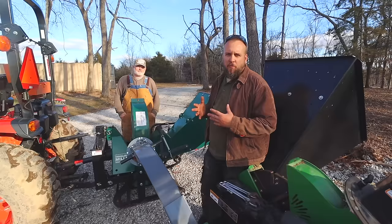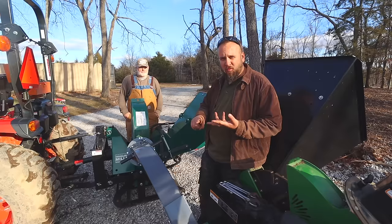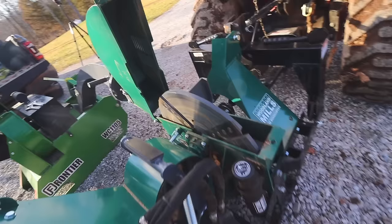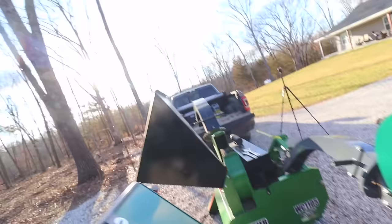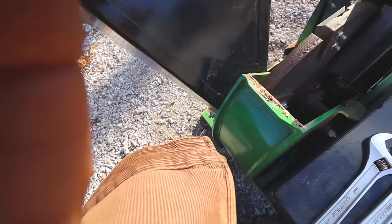The Woodland Mills — I thought it would weigh less because it looks smaller, but it has a lot of extra moving parts including a hydraulic fluid reservoir and hydraulic motor — so this unit weighs about 700 pounds, where mine only weighs about 375. The flywheel on that one is three-quarter-inch thick steel, with four long blades on a 24-inch wheel that weighs about 100 pounds. The heavier the wheel, the more momentum it has and the stronger it is — it's better to have a heavier flywheel. This one has an 80-pound, 18-inch flywheel, but it's one-inch-thick steel, and the knives do not extend as far out on the wheel.